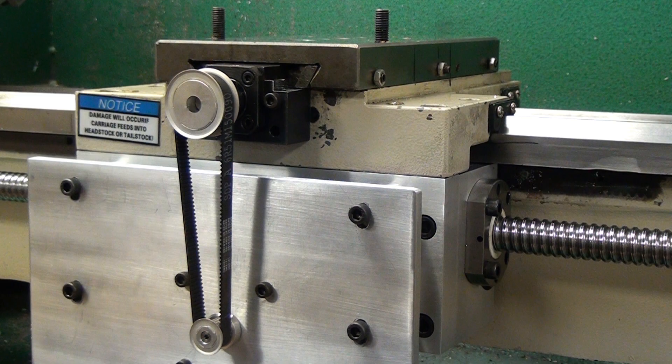In this video we're going to finish up the x-axis for the G0602 CNC conversion. I'm not going to go over the Fusion 3D model because we did that in an earlier video. The only extra thing to show is this front plate. You saw the model in that earlier video but haven't seen the plate itself. Besides drilling and tapping there's not a lot to it, and you could make it just about any size you want. On the backside there's one little area machined - a circle that gives clearance for the stepper motor. But for now we're going to jump into the lead screw.